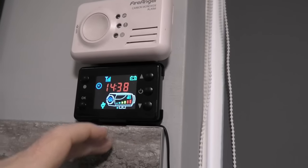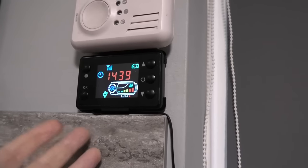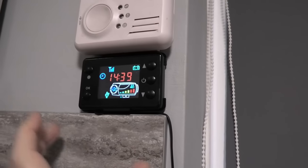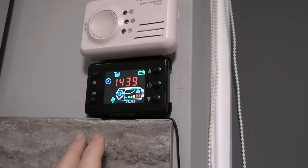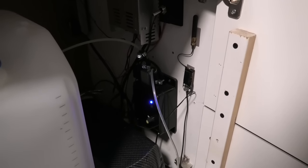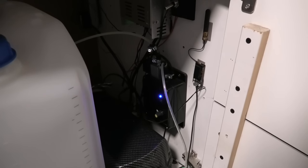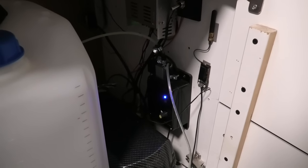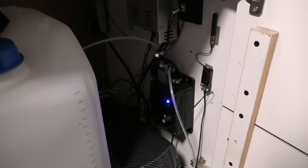My current pump setting is 3.8 Hz versus the factory default of 5.5 Hz — that's a 34% decrease in fuel, and I get exactly the same heat output confirmed with my FLIR thermal camera on the outlet. No smoke, no coking, no pollution, no smell. I've also got no carbon monoxide build-up — my digital CO meter reads zero. There are no smoke particles and no pollution whatsoever.